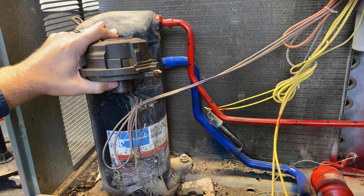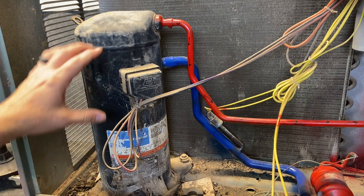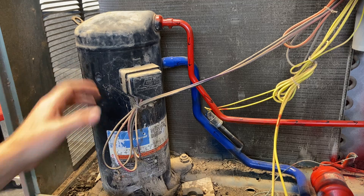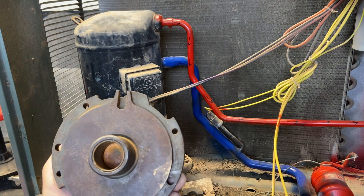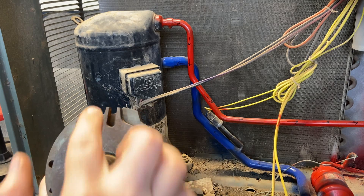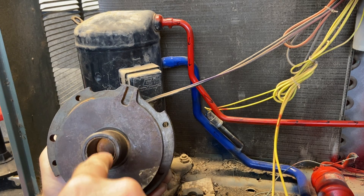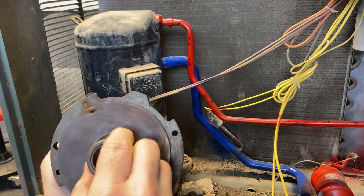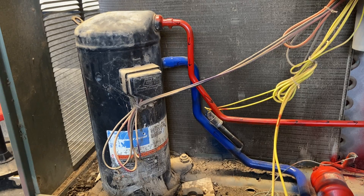Really great design. It's a lot more difficult taking these apart — I've taken them apart many, many times. If you take it apart you just see all that motor side down here. This is your main pump action and it's got three different slides that it hooks to — this one only has two. It just slides back and forth like this. The motor has an offset ring here and it just kind of like a hula hoop slides around. It's not actually spinning, it's just sliding around. That's your scroll compressor — very efficient, very effective. Thank you.